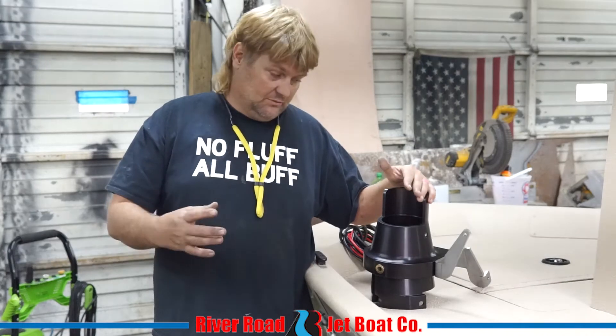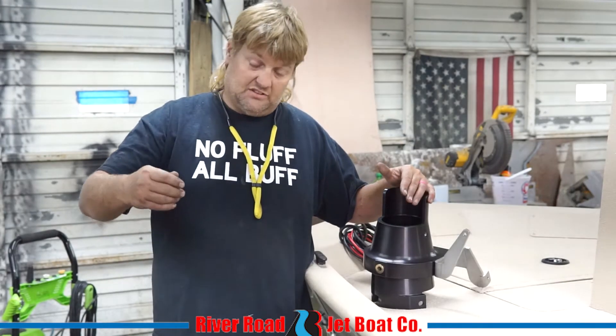When the pump has no air in it, it's getting the maximum bite. If there's air in there, it's just like boiling water, and it greatly reduces our performance — our hole shot, our top end, and everything in between. Every time that boat cavitates, we're taking a hit in all departments.